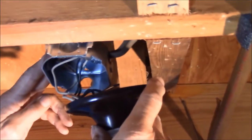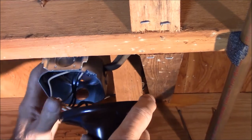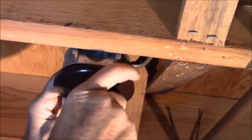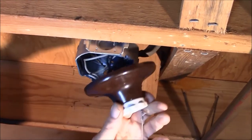Fold the wires. When you put the wires in, there's supposed to be six inches of unshielded wire in a box, which makes it good to go three and three inches so that when we fold the wires and put the device up like that, everything fits without cramming it.